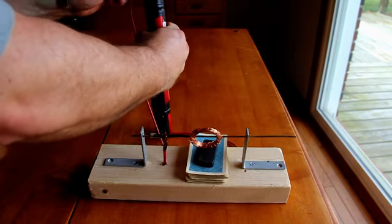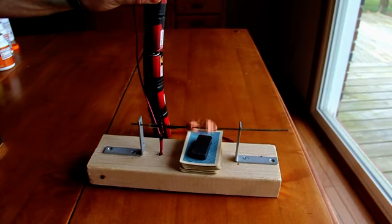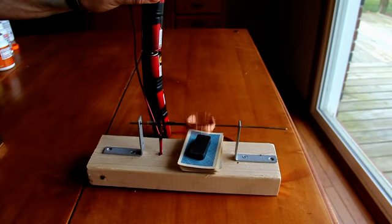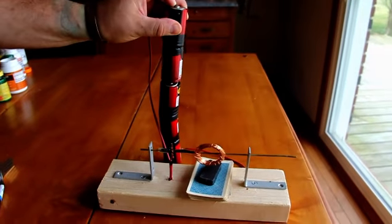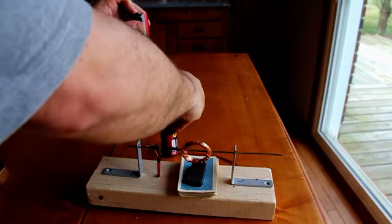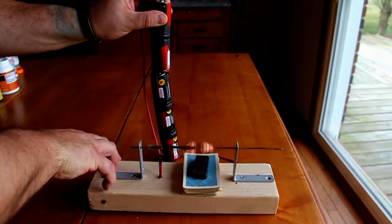Some designs call for using a styrofoam platform to make your half motor. That's way too flimsy for me, let alone a child. I prefer a nice sturdy piece of 2x4. You drill one hole in it for the brushes to go through. That keeps them in place. And then you can get the metal brackets at any hardware store. And the bar that the coil is on, that was cut from a metal hanger.